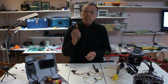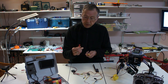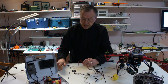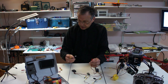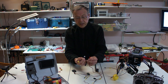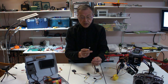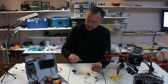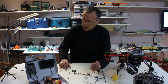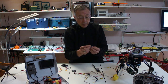Today we're going to be talking about powering up our video using the variety of cables. Along with the HXT cable and the XT-60s, I also use the JST plug — it's a plug I use often. This is not to be confused with the JST-XH, which is found on a lot of your batteries — the two, three, and four cell JST plugs. Not to be confused with this JST plug; same name, I think it's the manufacturer's name. Those are the main plugs that I use, as well as the servo plugs. I don't use the EC3 plugs, these little blue plugs, or the Dean's plugs — they're very popular but I don't use them.